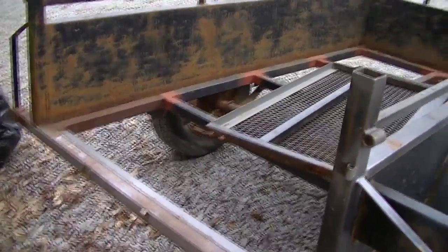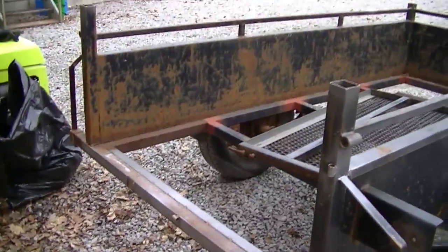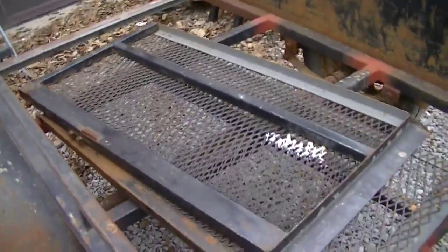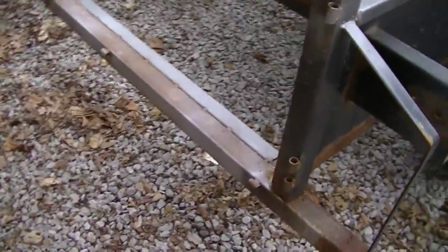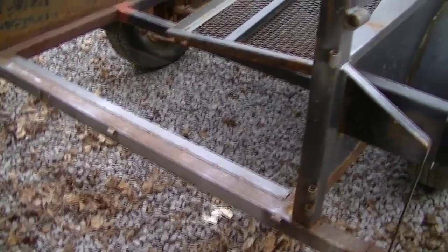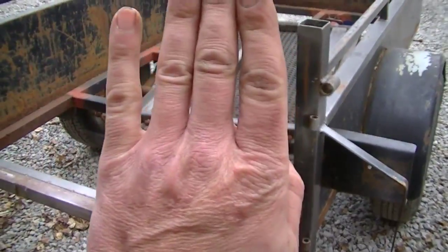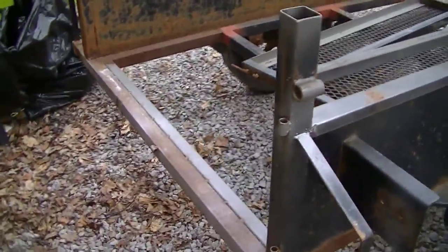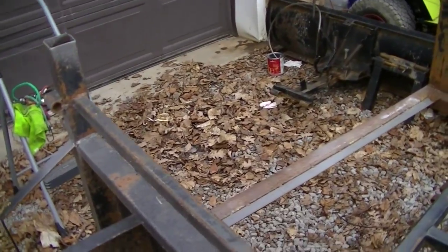After replacing the frame, I looked at the one-piece drop-down gate — and if you look carefully, you can see it's two pieces. I decided that a one-piece drop-down gate was cool for loading tractors onto, but a bit of a pain when you're moving other stuff on and off, and it was definitely heavy enough that taking it off wasn't an option. So I wound up splitting the ramps into two pieces. I did some experimenting with hinge points, and what I'm going to do is double-hinge the gates so they can either open up like a ramp dropping down, or like a barn door opening out sideways. You'll be able to pull the vertical hinge pins to drop it like a ramp, or pull the horizontal hinge pins to swing it out like a gate. And when you put all the hinge pins in, it'll just hold them closed.